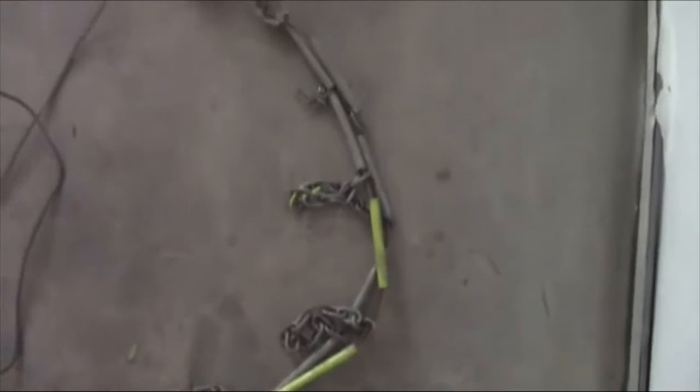In between, it gives you a basket when you go to pull your boulder, so it doesn't fall out. You get these centered on the boulder, and it won't roll out through the middle. And it's bigger chains in the middle, and then smaller chains on the ends. And this is just half inch EMT conduit that I used as separators. And this has pulled many, many boulders out.